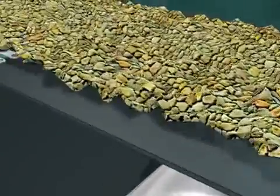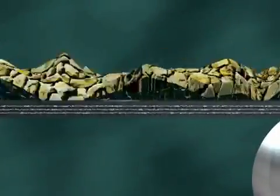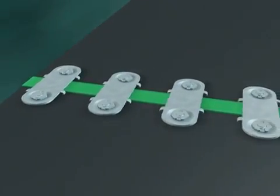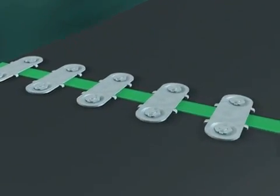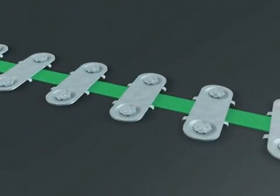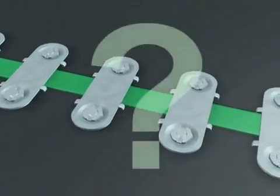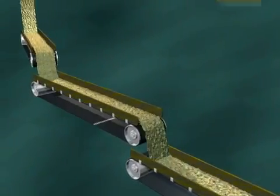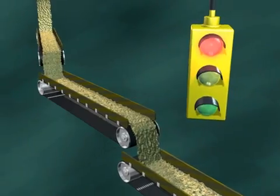Like most conveyor belt users today, you probably use belts with a synthetic fabric reinforced carcass. Synthetic carcass belts are thinner than older style belts with a thicker cotton carcass. Many users are still using larger number 2 or 1.5 style fasteners on thinner belts that have a synthetic carcass, without knowing that these types of fasteners were designed for thicker belts. Why does this matter? Used with today's thinner belts, number 2 and 1.5 fasteners may actually limit belt performance.